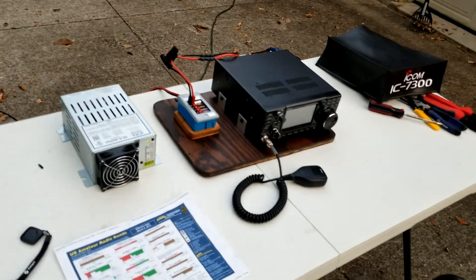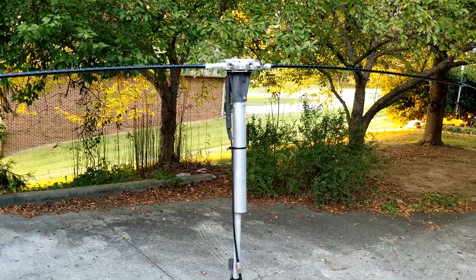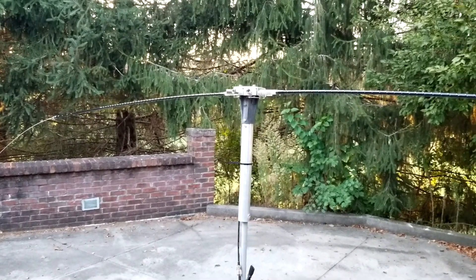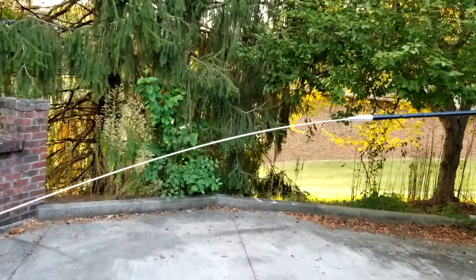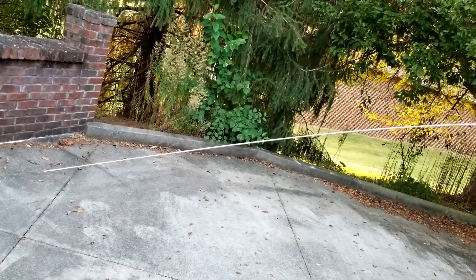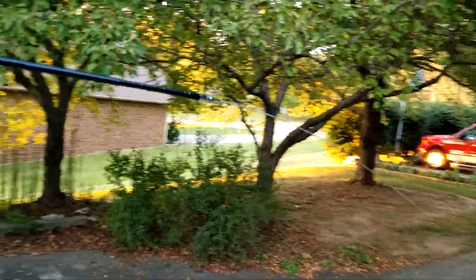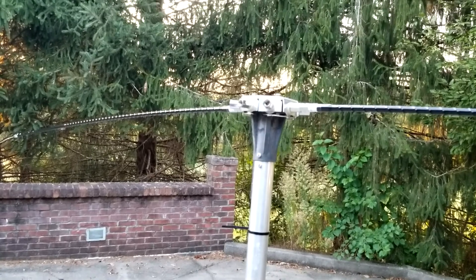We're doing an SWR antenna analyzer video, and so what antenna do I bring out here? Let's pan over and follow the wire — there she is. This is still one of my favorite antennas when I'm on the road. Today I have some new hamsticks that I need to tune. The way the octopus is tuned, you take these stingers — the stainless rods hanging out the ends — and you move them into the sleeve as necessary on both ends to achieve resonance for that frequency. You use your antenna analyzer to help you find where that is. These are going to be set for 40 meters.